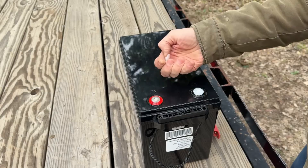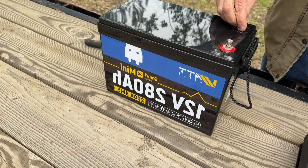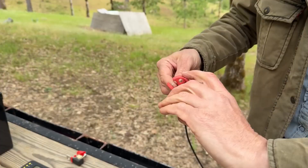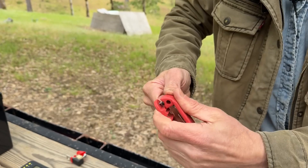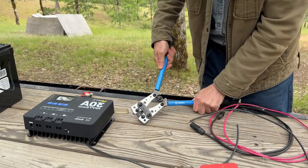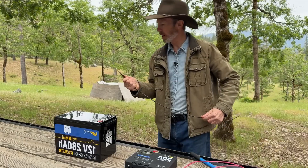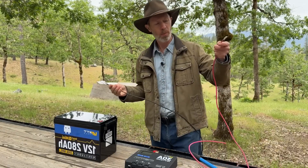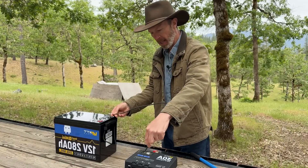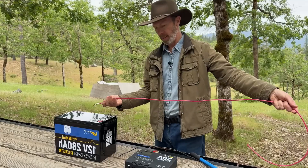These lithium LiFePO4 batteries, which are what a lot of people are using now, have bolt terminals. Put a ring terminal on the end of the wire using your favorite wire stripping tool. I have this fancy crimping tool which can be bought inexpensively — makes a nice solid crimp. We go from negative on the battery to negative on the charge controller where the little battery sign is, then positive to positive.